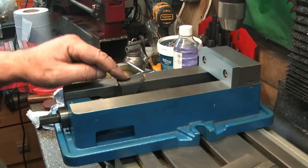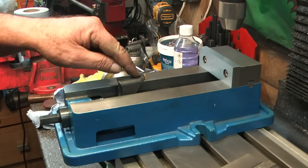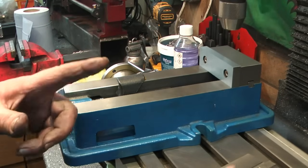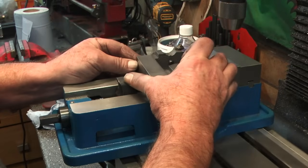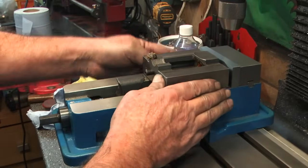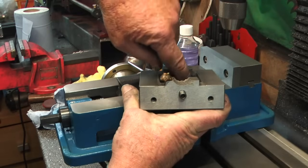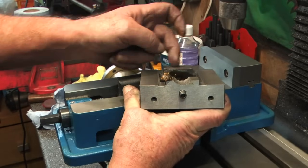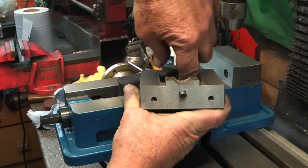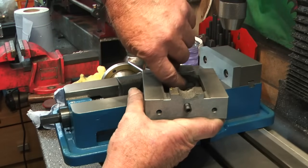So we've got the lead nut here, the pusher, puller, shall we call it. It's got a steep angle on this front face, and you'll see a bit of grease on there, which is meant to be there. And we've got this back face, which is a slight angle. In the moving jaw, which I've just stoned, and this is upside down as you can see, there is a ball indent. Very difficult for me to show down in here. Let's make sure that grease is in the hole. A half round, a spherical indent, and there is a ball or half ball which fits in that spherical indent. I don't know whether you can see, but it rotates and swivels around in that pocket.